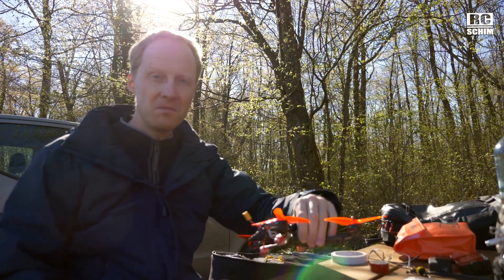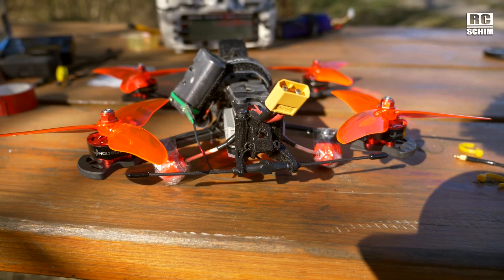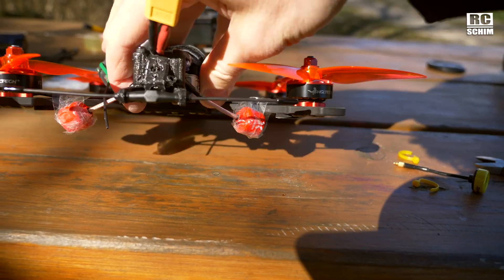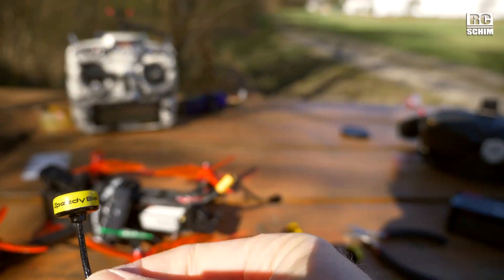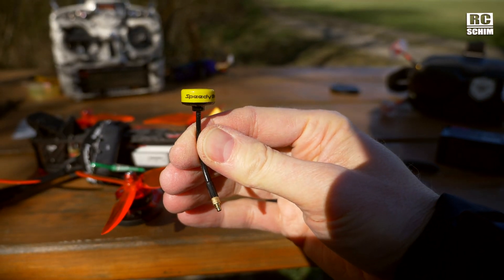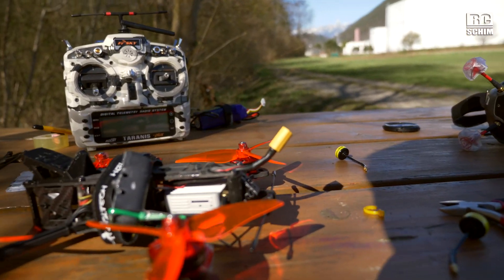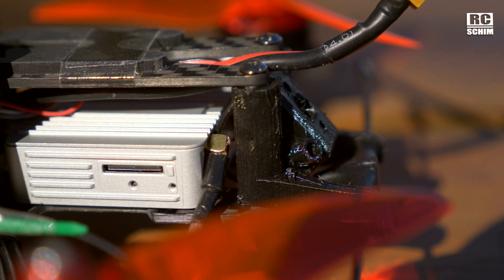After some taping and improvising, here's what I came up with. It's not elegant but it's a quick solution. I have one problem though: I initially thought I could use those B2B antennas, but they have a straight connector rather than an angled one. The space here doesn't permit a straight connector — you need an angled connector.